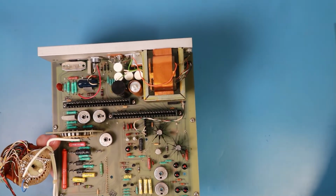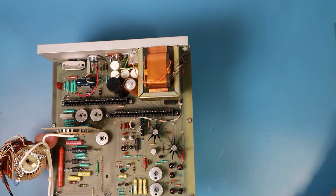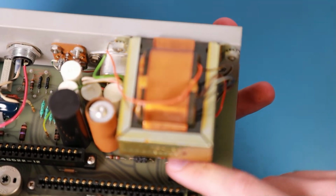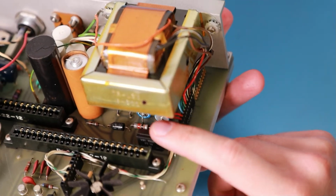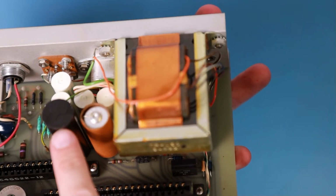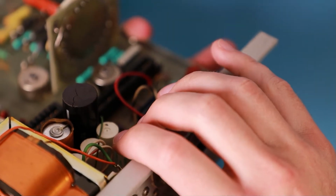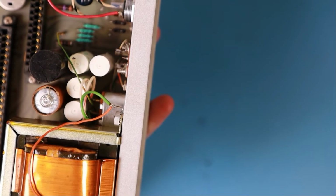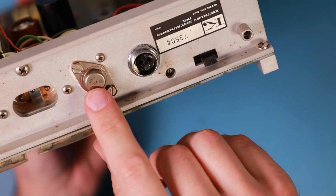So on the back of this PCB, it seems that this is the power delivery part. There are two big fat diodes under the transformer, another one here, and a bridge rectifier here. There are a lot of capacitors, including the one that's broken. Yeah, that is the split capacitor. Interesting name. A couple more capacitors. Then there is a transistor, which will be used for voltage regulation.